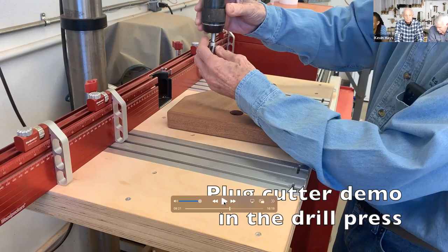Well, what about the 1 and 2 setting though? You were talking about the 1 through 12. Okay, I get that now. Yeah, but the 1 and 2 is like the slightest, tiniest amount of torque. Once it reaches that point, it'll spin freely and disengage the clutch, and that way you don't strip out the really tiny screws. So 1 has more torque and 2 goes faster? No. The torque is just the amount of force.